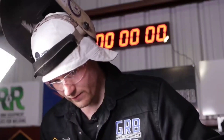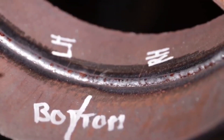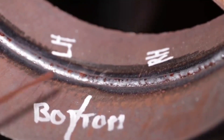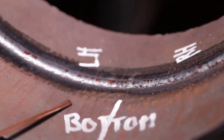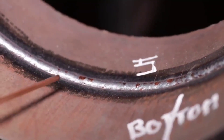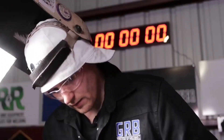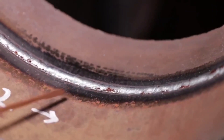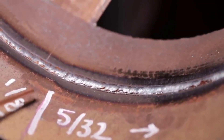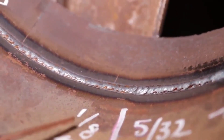You see me jumping around from side to side of the pipe, and it's due to line of sight, how easy it is to do the particular kind of welding, my placement, body positioning. At the bottom of the pipe, I use the 5/32 for the fill metal — I get a little bit more build-up. This is a continuous feed technique. Carbon steel, like I said a little bit earlier, you do not want to use a dabbing technique because there's no inert gas internally inside the pipe, and every time you remove the tip of the fill metal away from the weld puddle, it oxidizes in the presence of the atmosphere, which ends up introducing oxide to your weld puddle.